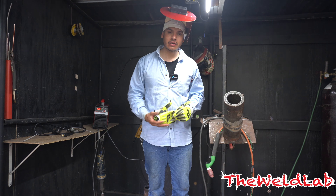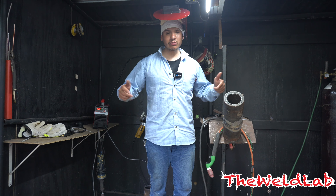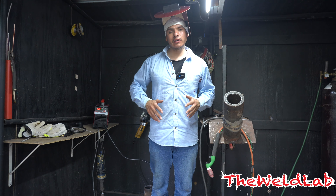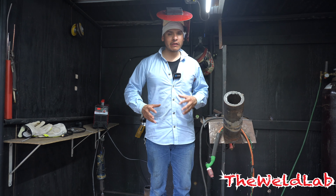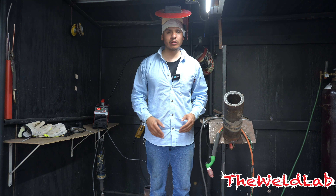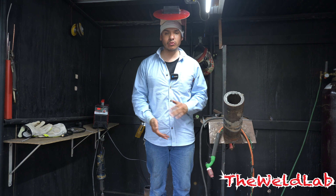It was great for 7018. Like I said, just to have at the house to do projects or even learn how to weld — I wouldn't weld anything heavier than four-inch pipe because I feel like you'll burn the machine out. But other than that, it's a major win. From one to ten, I'm gonna give it a 10 with 7018. I'm gonna give it a seven with TIG simply because 160 amps is not enough — you might need a little more heat. If you want to weld something smaller like a two-inch pipe or small stuff, it'll do a good job, even sanitary work. But if you're trying to practice on bigger pipe, you might have to level up and get a bigger machine.